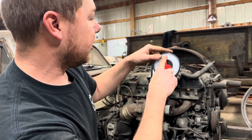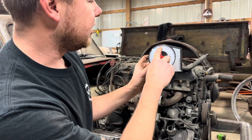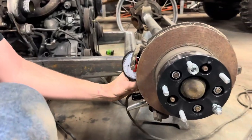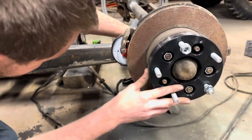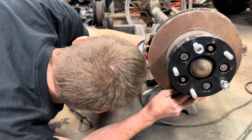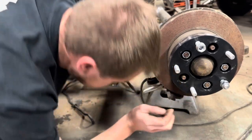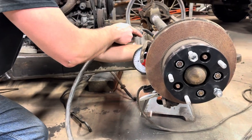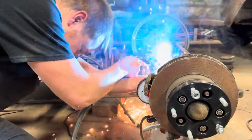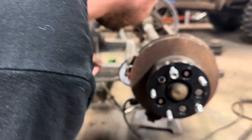Since this thing is at zero, I need the magnetic base to be over here. We're going to go off this 90, then lay it back until it hits the 85 mark. So we put this on there — there's 90, and we're going to go to 85. I think that's 85 there; it's hard to tell. All right, there's 85. So now we're just going to tack our axle to our jack stand. It kept wanting to rotate — I think it's really, really close.